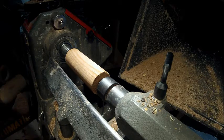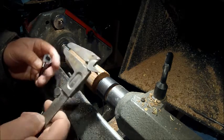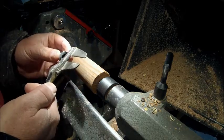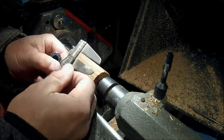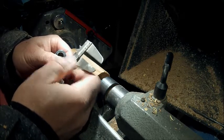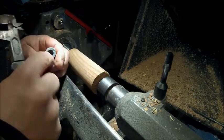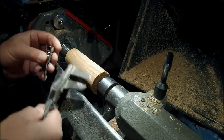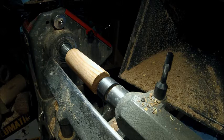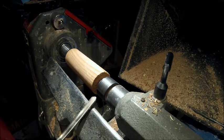What I want to do is take some calipers — just pick these up from Harbor Freight, real cheap. We want to measure the inside diameter and lock this down; that's going to be the thickness of the spindle. Now this tapers a little bit so we'll try to account for that. Now let's just kind of rough in our shape a little bit — we'll do that with just a roughing gouge or a little spindle gouge here.